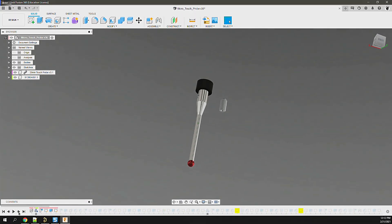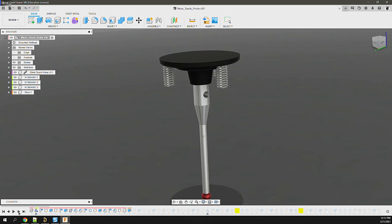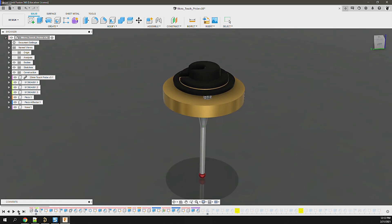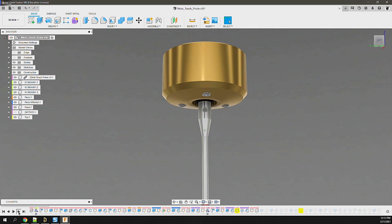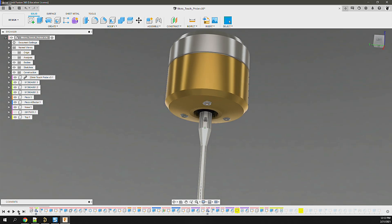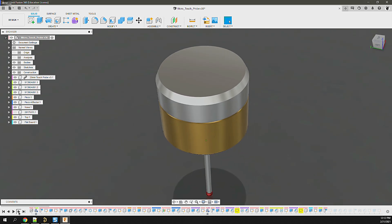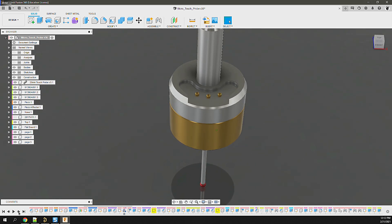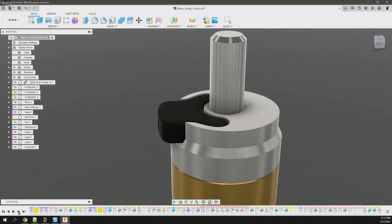With those things in mind, I started with the stylus and began to model the solution from there. I modeled the adjustable stylus tray and piezo effector — a component that interacts with the piezo-ceramic when any movement occurs. Next, I create the brass nose, which will enclose the probe internals and host three adjustable grub screws to tram in the stylus. This will be a two-part assembly, and to connect the parts, I apply M18 threads to an internal lip on the cylinder. I then model the top side from aluminum, which will house the circuit board and expose the pins for the connector. This initial design will have a quarter-inch shaft, but it could be swapped out for an eighth-inch shaft. For the connector, I'll use pogo pins. I model those, then the board, the spring, and connector to finish off the design. With the design coming together, I export the board shape, then go back to design the PCB.